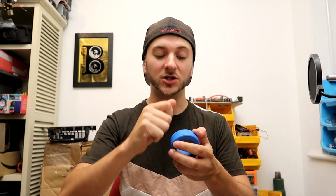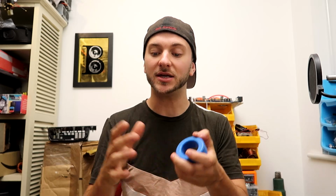But that's the plan, is to order some wire, get the transformer wound to high quality, really nice and tight, equal space windings, so that there is minimal ringing, and just so that that whole thing is done and perfect, so I know that any issues with the amplifier aren't coming from the way that the transformer's wound. So get that done first.